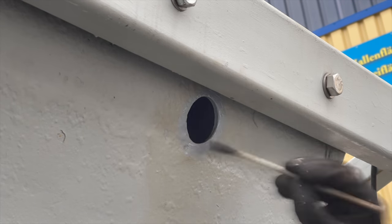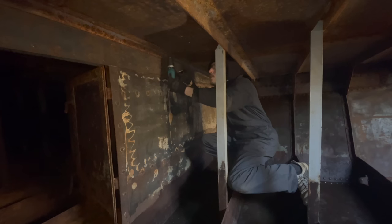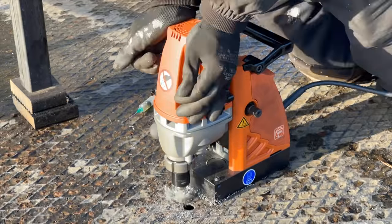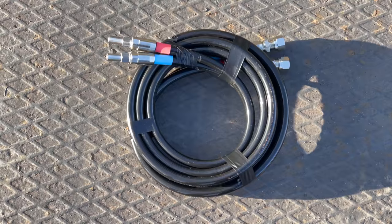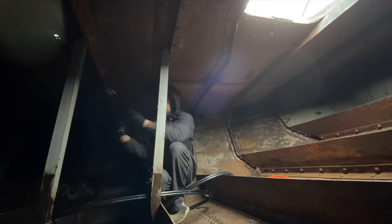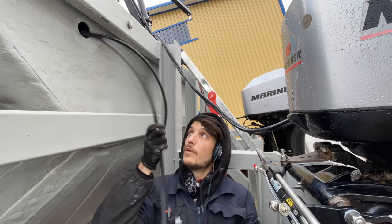I can pass all the engine cables and hoses easily into and out of the boat. In order to get the hydraulic tubes up to the wheelhouse, I have to drill a hole through the deck. I first mark the position from below with a very thin drill bit, then drill two bigger holes right next to each other with the core drill. Now I can install the first hydraulic tube and pass it through the deck into the boat. I attach the tube to the ceiling wherever I can, and then pass it through the hole in the stern all the way to the hydraulic cylinder.